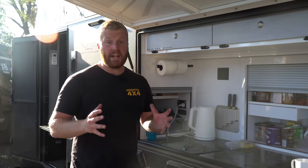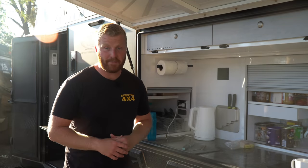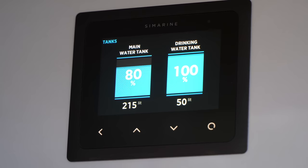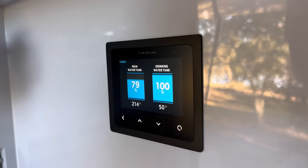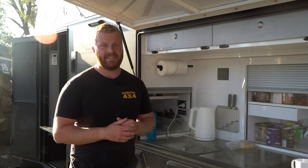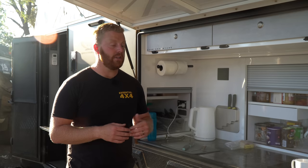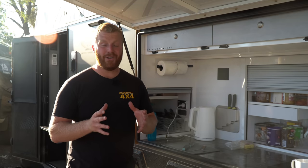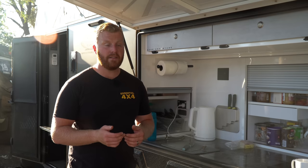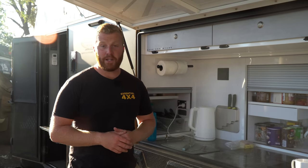To monitor the water tank status at any time, we have the Sine Marine control panel mounted in the kitchen compartment. The two tanks are displayed in both litre and percentage capacities. After six months of use, we have come to realise that this isn't an exact measurement, but simply an indication. This is because the sender units in the tanks are just float-style senders which estimate the water remaining on a water level within those tanks, not on flow output. It's just something to keep in mind, and as those water tanks come down, it gives you a good indication as to when you should start looking for points to refill.